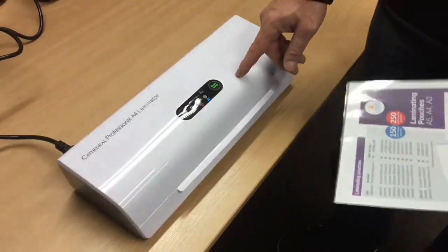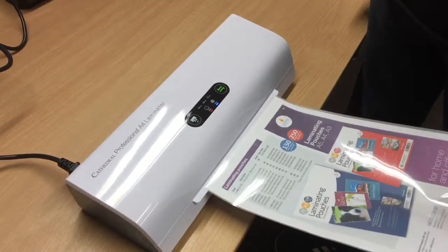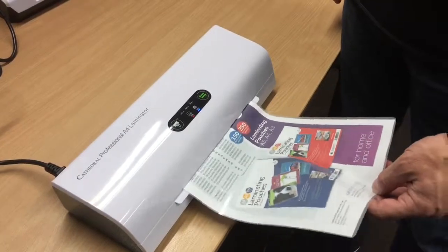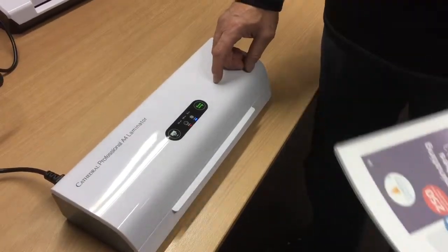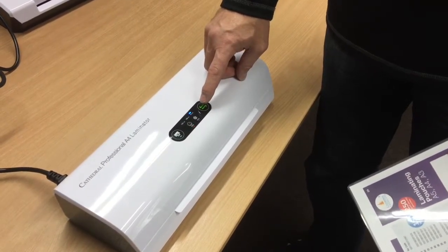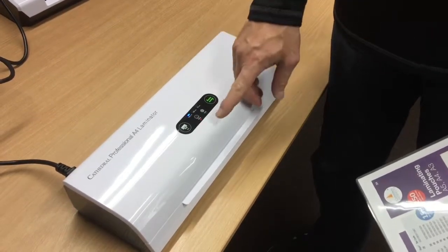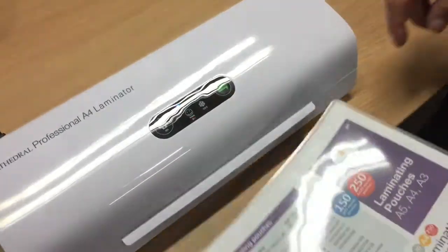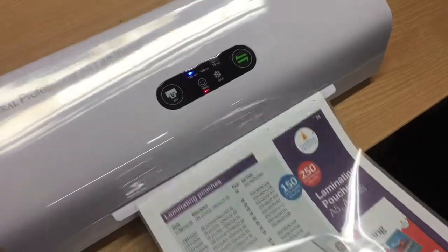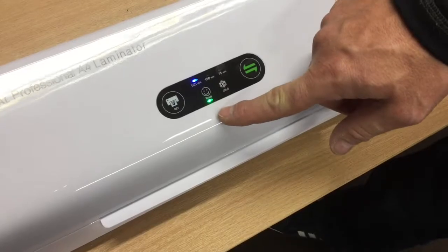This one's got a gate function — because it's not ready at the moment, when you try and use it on cold, it won't actually go in. So it's on 125, or 250 — 2x125. Select the function button to the 75 micron, again to the 100, then the third time gets you up to the 125. The light's flashing red, which means it's not ready. We can try and put it in but it won't work until the lights change to green. You can see the solid green light's come on now, which means it's ready to work.